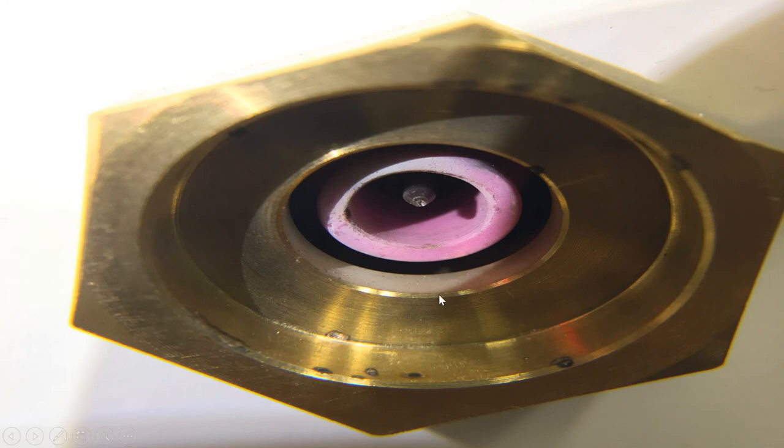This creates a shield on the welding point. Here is a magnified picture of the welding points. This is the welding electrode and this is the copper piece — that's where the current is going to pass from the electrode to the wire. That's how your wire is going to be melted, which results in creating the welding joint of the wire.